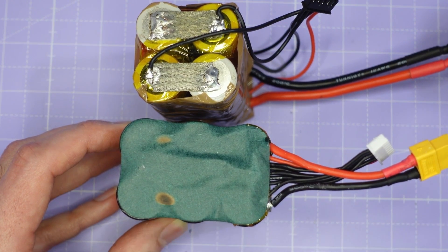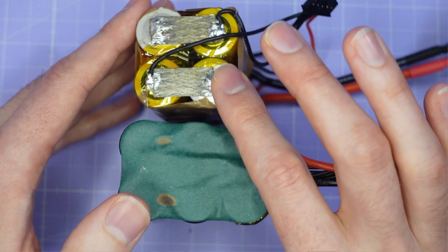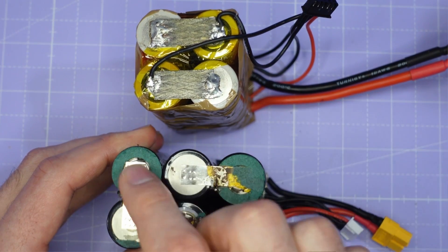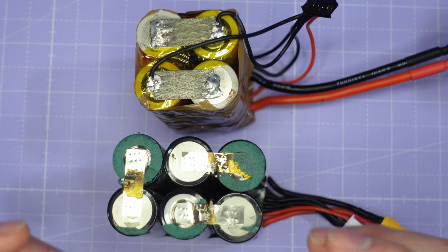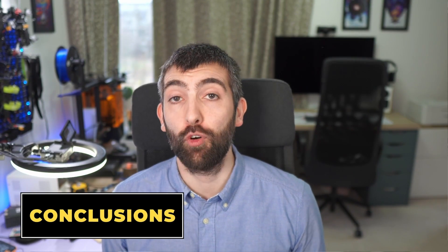You can see really clear evidence of this on the Goldline pack - there are brown charred areas where during the burst test the nickel strips got so hot they charred the adhesive used to attach the foam on the bottom of the pack, and they got hot enough to char on the top of the pack as well. Compare that to our copper braid which I checked straight after the burst test - it wasn't even hot. The extra resistance of those nickel strips is clearly affecting the pack's ability to deliver current and reducing burst performance. So there we have it: if you want the best performing lithium ion pack for your long range drone, don't discount DIY - you might be able to buy better cells and build a better pack than one you could buy. I hope you enjoyed this video; there are links down in the description to my previous lithium ion battery testing and my website aosrc.com. Until next time, very happy flying.